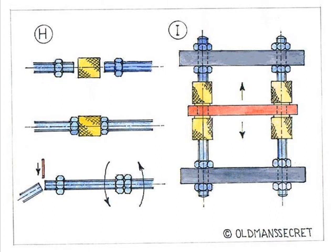A tip here on working with screwed rod. Fit two hexagon nuts as shown, one being tightened up against the other, finishing with the flats being in line with each other. This can then be used for clamping the screwed rod in a vise without damaging the thread. Also, when cutting, screw on a nut first. After filing the end smooth, the nut is removed, which clears the thread.